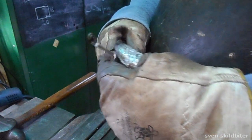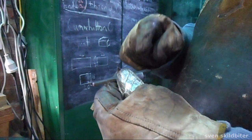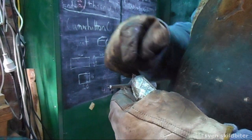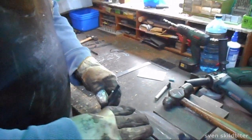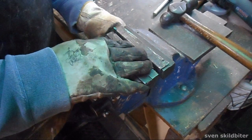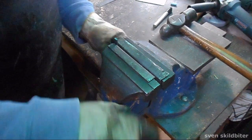The next piece I actually need to put a stop on. I need to clean that bit up first. The slide goes backwards and forwards — this engages the hasp, and this is bent to make a stop. To make that into a stop, we're going to do a bit more cold work and turn that at right angles to the bar, just using the big hammer again.